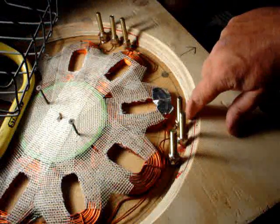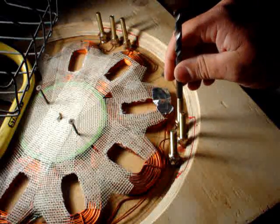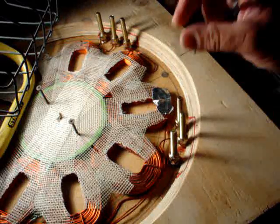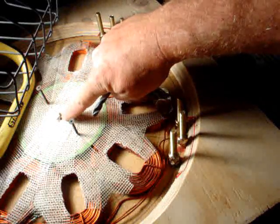Okay, on the edge of the lid here for strength, I cut it, put a line here where I'm going to cut into, and the same thing over here. The diameter of this bit is the same as these 5/16. I'm going to wallow the hole out a little bit. This is going to be coated with wax, a straw slid over it, and then when the lid comes on, this goes on, and the center of the lid is going to peg here.